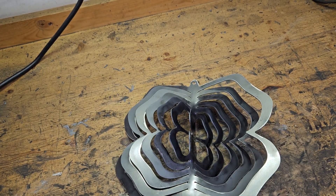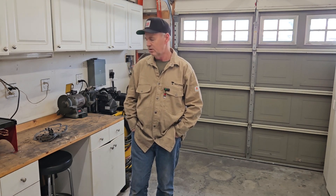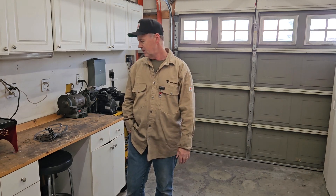That's it for today. A little bit of a clickbait - I did fix a mistake on my table. The spark arrestor catcher pans were a bad idea. Don't use cookie sheets. Probably a water bath, something deeper like a sink, would be better. I may work on that at a future date, but for now we'll just continue to let the sparks hit the floor. We did an experiment on a cookie sheet from a dollar store. That stuff is 26 gauge at best, and it cut okay, but it's so flimsy it's like cutting out of aluminum foil. It definitely isn't good for a spinner. If you're just cutting out shapes to hang on the wall - horses for your daughter's bedroom or something - maybe that makes sense.